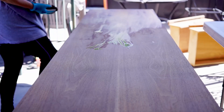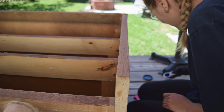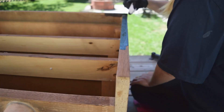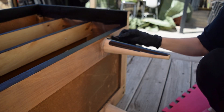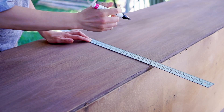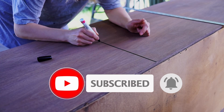Here you can see that big scratch — it's still there. While I was staining, an idea came into my head. For that idea I needed the edges and frame of the dresser blocked, but I didn't want to paint it because I wanted the wood grain to be as visible as possible. So I decided to go with ebony stain. My idea was to draw lines through the burned veneer spots and through the scratches to mask them, then add random lines here and there. Honestly, I was really worried that people wouldn't like it — those lines don't give a classy mid-century modern look — but I decided to take a risk.